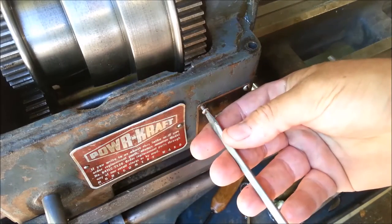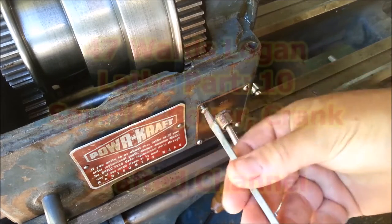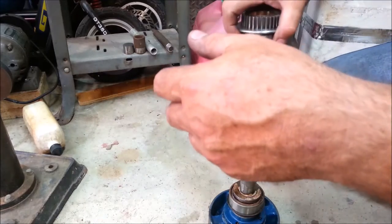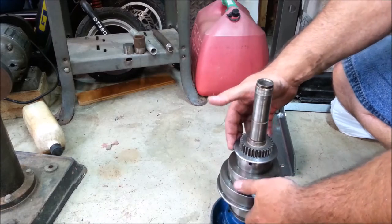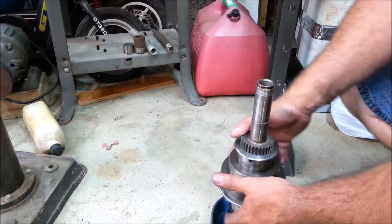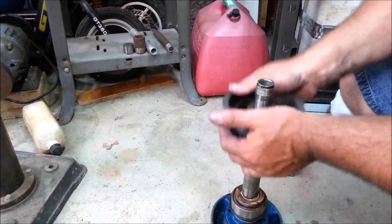It's never a bad idea to turn a screw backwards until you feel it drop back down into the thread — right there. I think I've got it fitting really good now. Where it locks up, it's actually down on a woodruff key that's angled in its seat. That's a beautiful fit. It doesn't run this way, but it fits good this way as well.